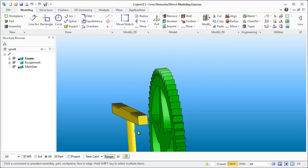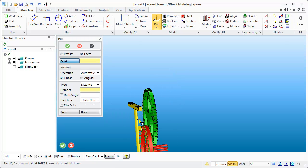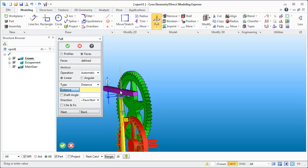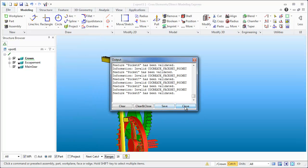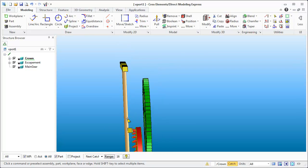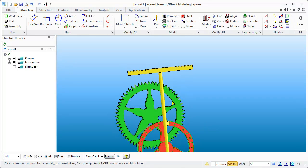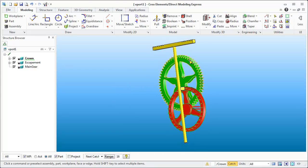What I actually want to do is Pull. I'll use Pull Faces — grab just the top faces, and at this point I can start pulling this up. Let's make it 70 and hit okay. Now I've managed to extend that geometry really quickly using Pull on a bunch of faces all at once. The pendulum is now as high as I need it, so when I build the frame I can position it at the correct height.